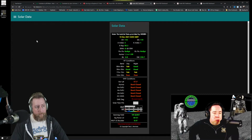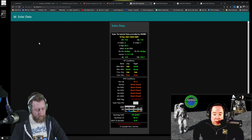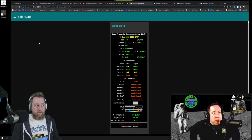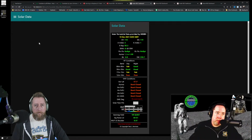The one way that you could do it is, let's say that your radio's got a serial port on the back of it. And it's RS-232, which is just serial protocol data. Elecraft does this great, where it's got an RS-232 port on it, and you can go to Elecraft's website and feed it a command. Let's say it's the command F. So you can interject the letter F into, all right, let me go backwards.